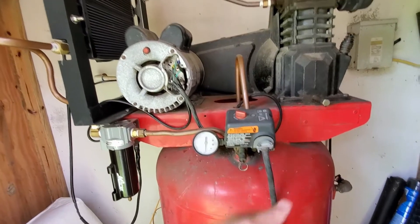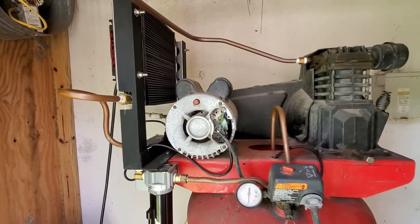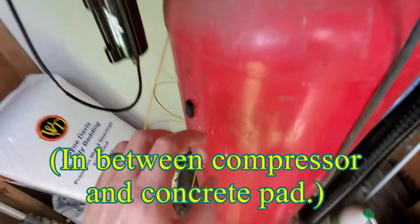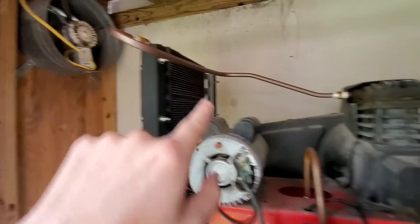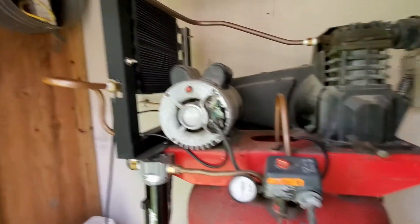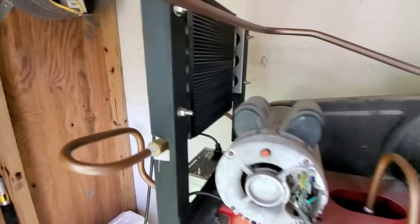This is a pretty old compressor, which I don't think is helping at all. A few things I can do to address this: bolt it into a concrete pad with some rubber pads underneath, and brace it from there to there — that should fix the issue. Just wanted to provide a quick update: if you do something like this, vibration is something that could kill your system, and it certainly did for me. Thanks for watching, good luck.